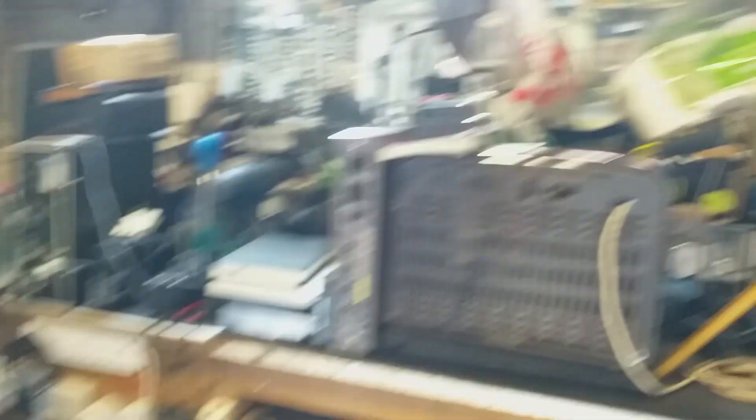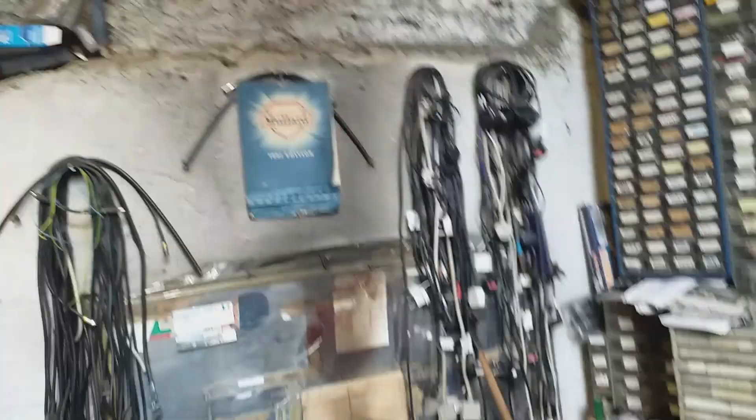What's this — an amplifier? Yeah, that's an amplifier. That's a serious one. It's a pair of 813s. They'll tell you they'll do 400 watts, but I'll do a bit more. I ran that for probably about five years. On teletype it's 250 watts or thereabouts. On SSB I could get 700 watts without any trouble whatsoever.